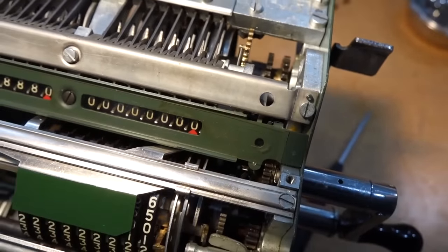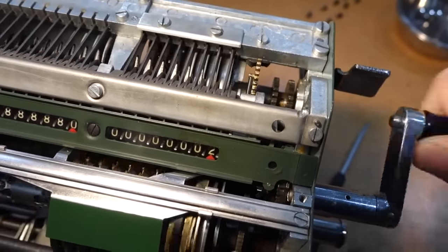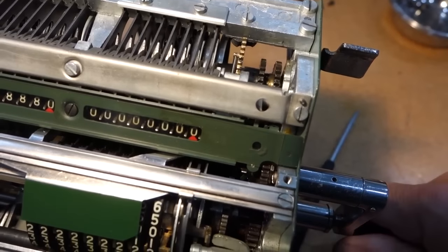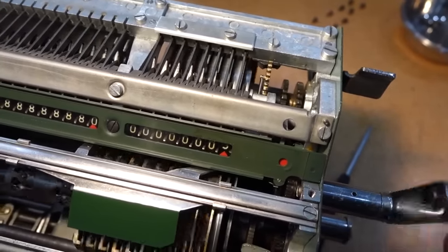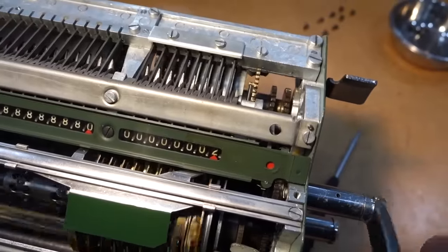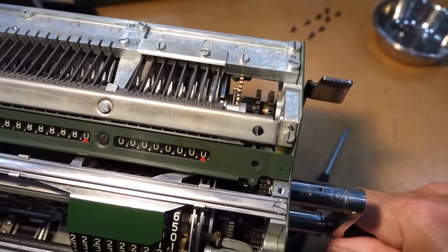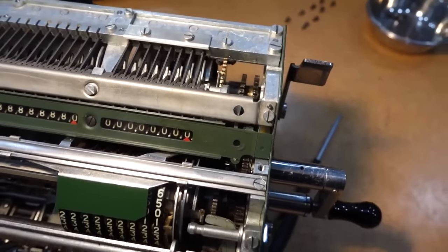And a view of the counter auto-reverse mechanism. You see those two wheels here — so if I start with a forward crank, they all move in unison and this thing is counting up. Now if I reset and start with a reverse crank, now they move reverse. And it will keep moving reverse even if I count the other direction. So now this is a positive turn — one, two, three, four — and this is a negative turn. The only way to reset this is to start again, and now this is a forward turn and it counts the other way around. Very clever.